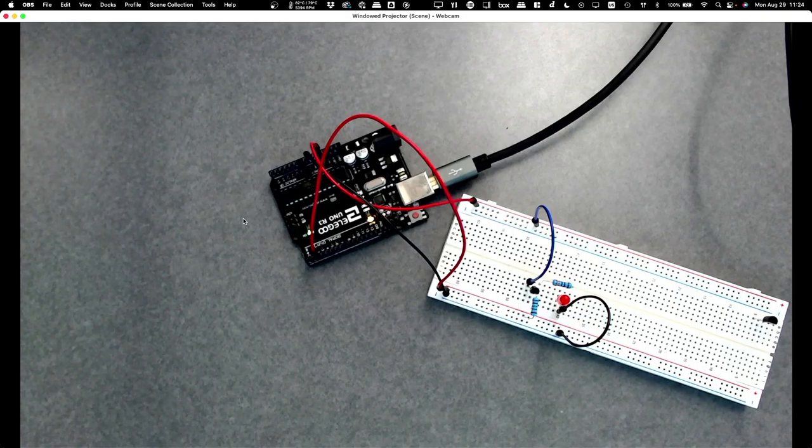Okay, so how I've got it is the pin, this one, is turning on and off, and that's what's connected to the base of the transistor. If the thing connected to the base is on, it turns the transistor on. And if it's not, then it's not. Okay? So I now have a switch that allows me to control whatever is happening with the light. Okay, so does that kind of make sense? Yeah? Okay.